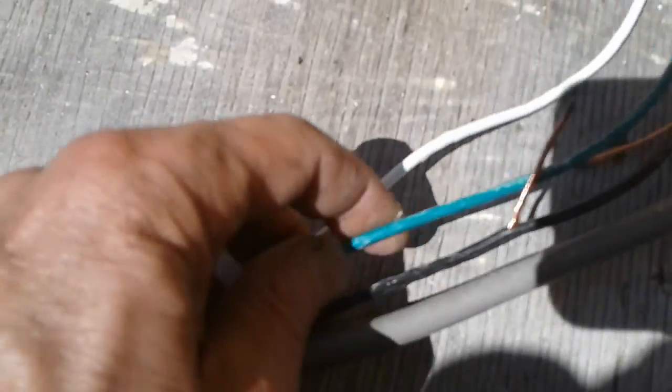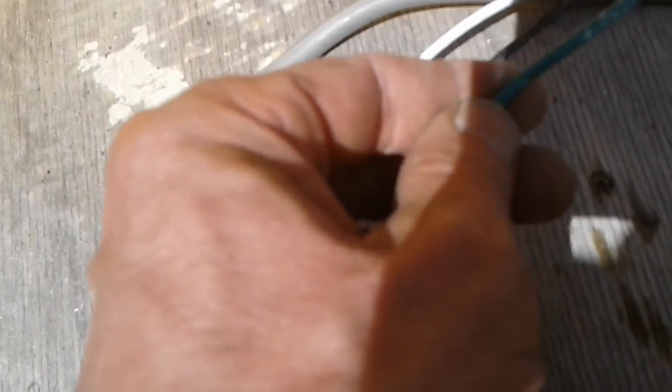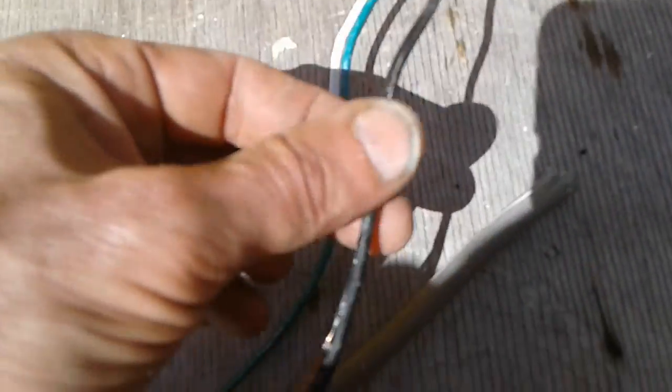So I gotta open up that cord. I've already tested the green one. The green one feels okay. There's no ripples inside the plastic sheeting. I'm feeling the metal, not the sheathing, to feel if the metal is actually bound up. You can feel it, and that's exactly what happened here. Could feel the break, I could feel the spot.